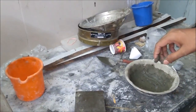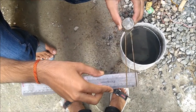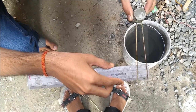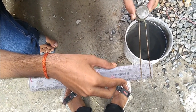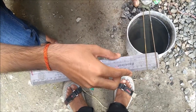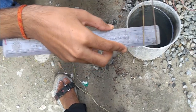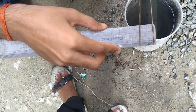The temperature of the water assembly should be between 27 to 32 degrees centigrade. This is the final specimen after taking it out, having been in water for 24 hours at a temperature of 27 to 32 degrees centigrade. Now we have taken out this specimen from the water bath and this is the first time we are going to measure the distance between the two legs of this Le Chatelier apparatus. Here we have taken the scale and the reading — that is the distance between the two needle points — comes out to be 2.7 cm.